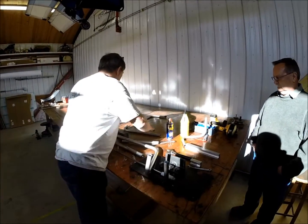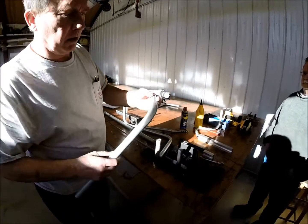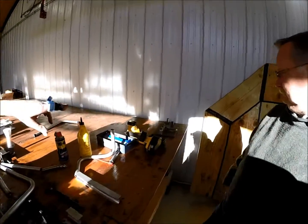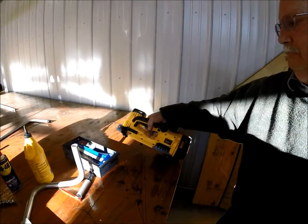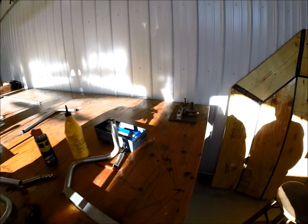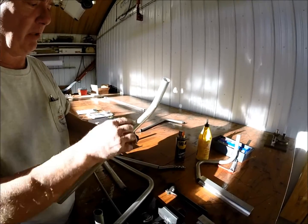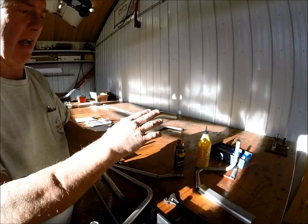This pipe here is typical of a roll bender — that's the roll bender over there. That's a standard roll bender, and this is what you get with a roll bender: you get crumpling on one side and flattening on the other.